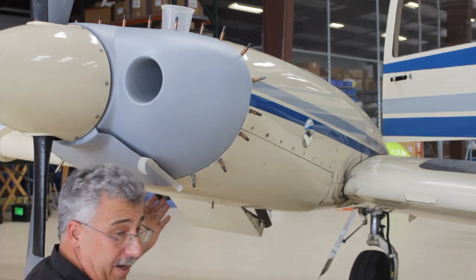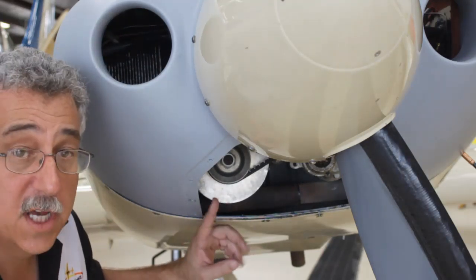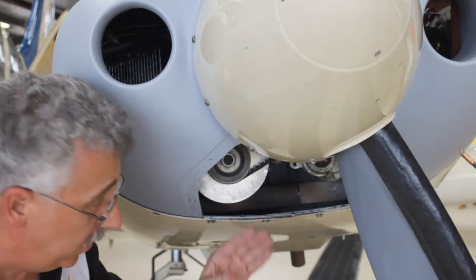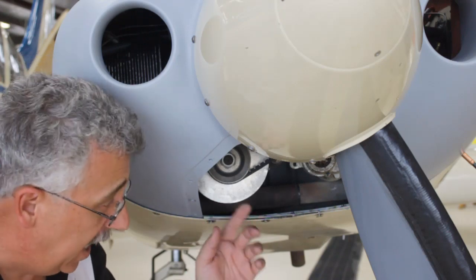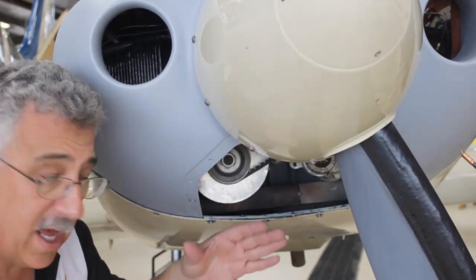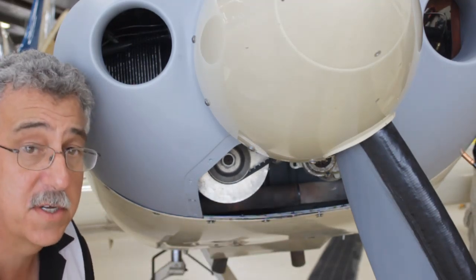We'll do the same thing across the bottom. Something to look out for: we're very close on the door to the alternator — watch that. You may have to go in and reposition this alternator to move it up by going to a smaller belt or adjusting an idler and repositioning it. So we've got enough clearance that we can go ahead and finish the fit-up and we'll check how much positive room we have when it's all set and done.